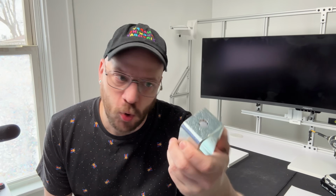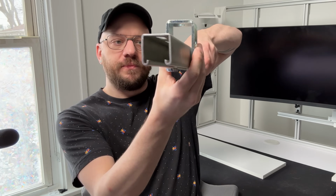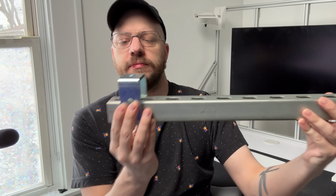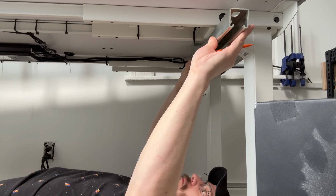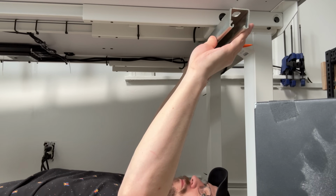Anyways, so this is a 3-part system. You have the trolley track hanger that secures to the ceiling or whatever you're suspending from, the strut channel that slides into those hangers. And then once that is secure in there, the trolleys then slide into the strut channel, with the trolley wheels gliding back and forth on the lips of the strut channel, thanks to the bearings.